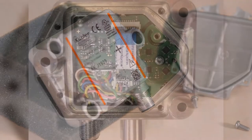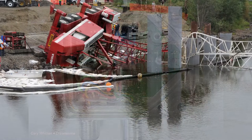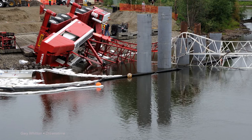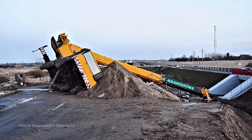These E1 and UL certified sensors use micro electromechanical system, or MEMS, technology with a mass suspended between twin capacitive plates. Tilting the sensor moves the mass and causes an electrical potential differential measured as a capacitance change.